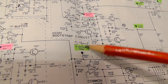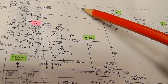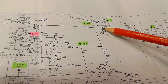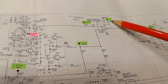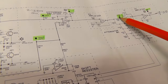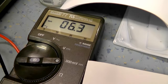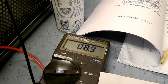It was originally 3.9 and I've dropped it back to zero. This point here is 2.1 positive. I need to check the polarities, but it's going to push this op-amp either one way or the other, assuming it's using a plus and minus rail. That's going to cause a DC offset shift. So let's have a look at test point 501 and see what DC level we've got. Looking at test point 402 — we've got an offset of 7mV, and we need to try and bring that down. It's running a calibration at the moment, so let's wait for that to settle. We've got an 8mV offset there, we need to get that down.